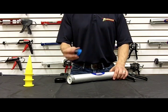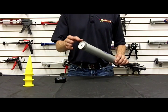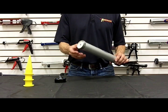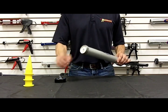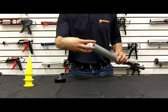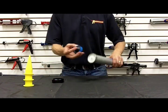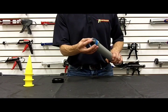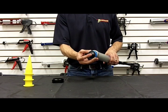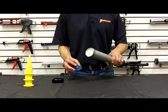It's also a nice system in that sometimes you'll have very thin materials — some self-leveling stuff, for instance — and the sausage pack may get pinched. Over time, these cups might wear and the sausage could get behind and get pinched. This cup system will essentially seal that inside diameter and prevent that from happening. For a bulk gun, it will also give you the vacuum you need to suck the material in.